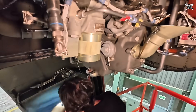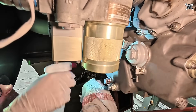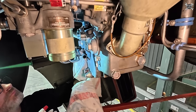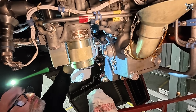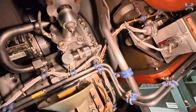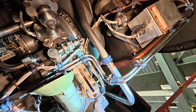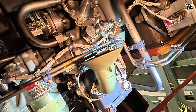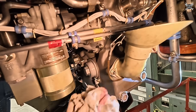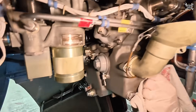A bit of cleaning. What's the oil level now? Above half of the sight glass. So that's not even half a can — we will see after the run. We'll test it first and do a leak check.